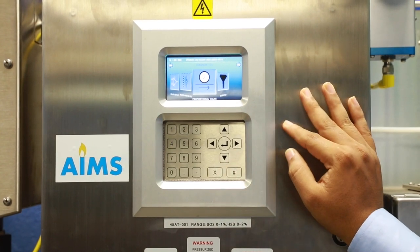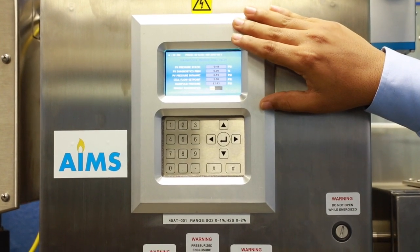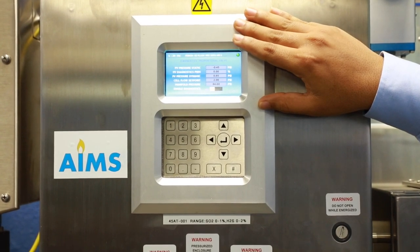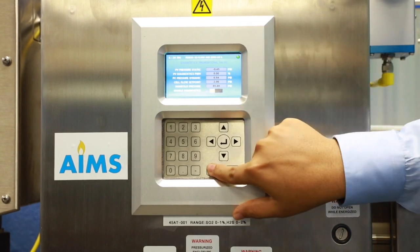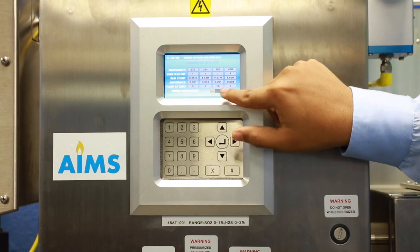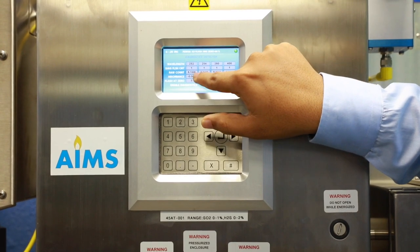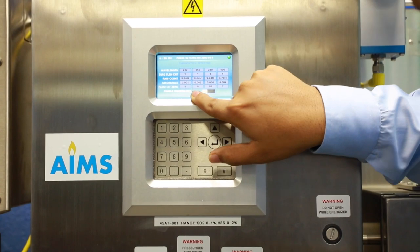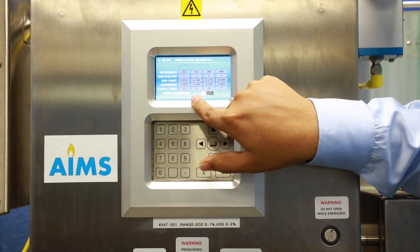The proportional valve diagnostics show essential parameters for the automatic aspirator flow adjustment — these diagnostics are performed when you are in process and automatic flow control adjustment is required. Under Detector Diagnostics, click to see wavelength diagnostic flash raw values, absorbance values, and flash-at-zero. Enable diagnostics if you want to test the pulses giving raw counts for the measurements.